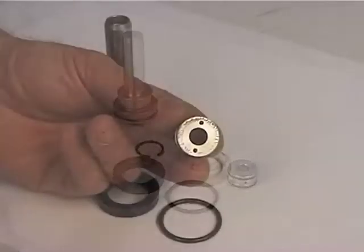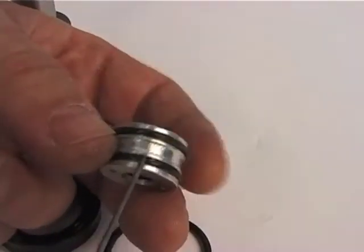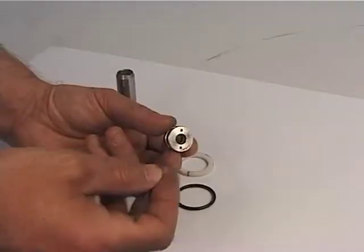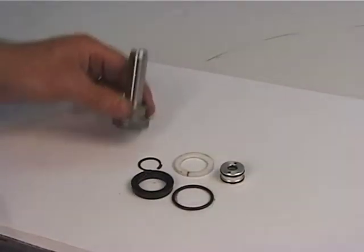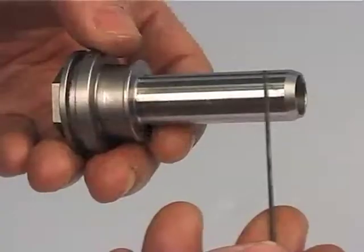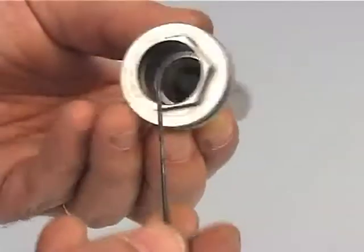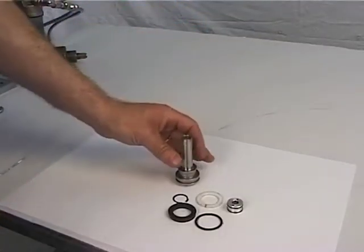Check the condition of the outer O-ring, figure 19, and inner O-ring, figure 20. Warning: always replace the O-rings when overhauling the tool. To ensure pneumatic reliability, before remounting the piston, check that the stem roughness is 0.2 Ra. Check the good condition of the bush seating.